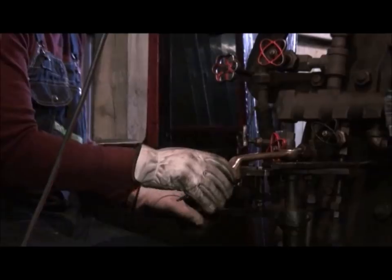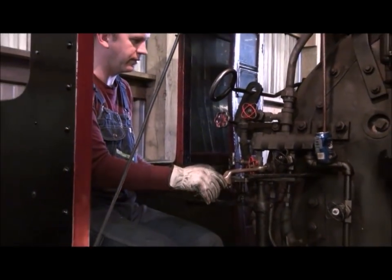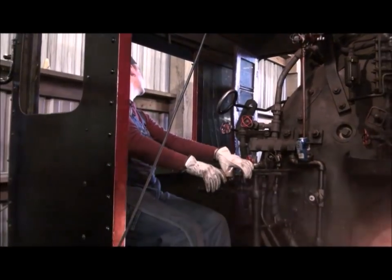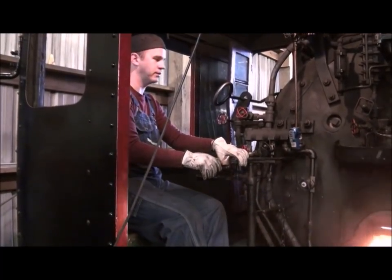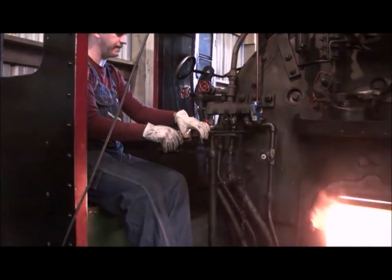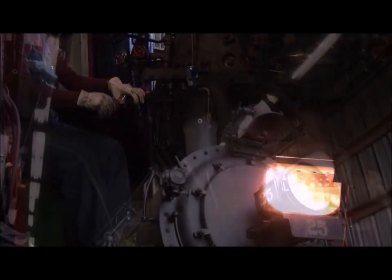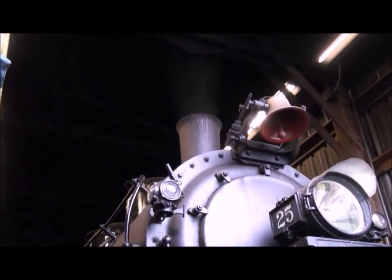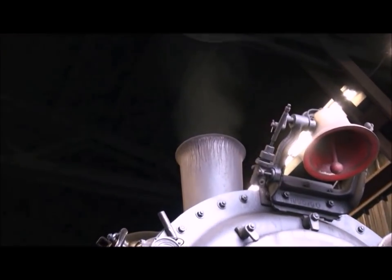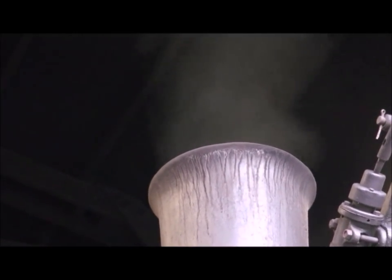Turn on your atomizer and your blower. You want to get that oil atomized into tiny droplets and get that blower going so it's sucking the heat up through the boiler and out through the smokestack. Do it really easy — you want just a little bit of fire to start, because it's easy to bring it up bigger. If you get too much fire to start, you'll end up with a big pool of burning oil at the bottom of the firebox. So only move it one notch at a time — it's better to have a little too low at the beginning than too high. Remember that a fire needs oxygen, heat, fuel, and a chemical reaction. If the fire is not giving you what you want, one of those things is not correct. Are we getting a lot of black smoke? No — we're getting just a little bit of gray smoke, which is exactly the way you want the fire to be burning.